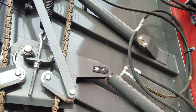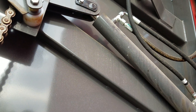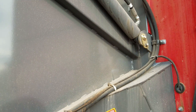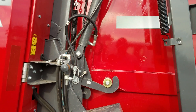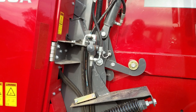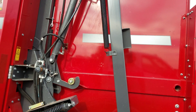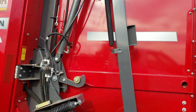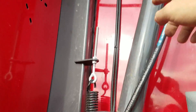One thing you'll notice: there are no twine boxes. The twine boxes would bolt in here, and all twine boxes do is collect dirt. I don't offer twine to my customers — it's number one: it takes too much time, and time equals fuel, repairs, everything on your machine. When they want twine, it's a minute more per bale, so I'm in the field longer, more chance it'll get rained on. Nobody around here does twine anymore anyway.